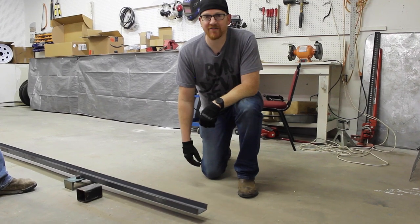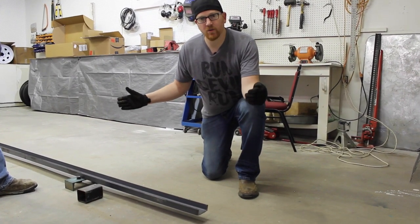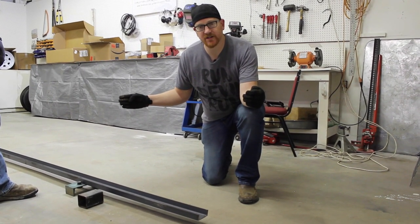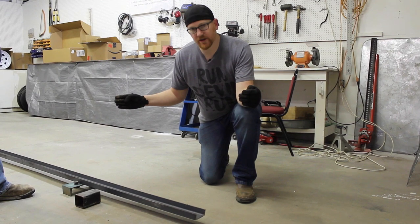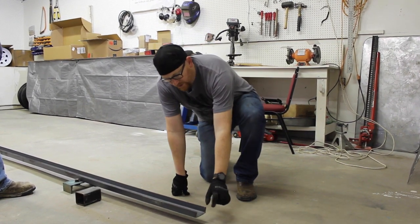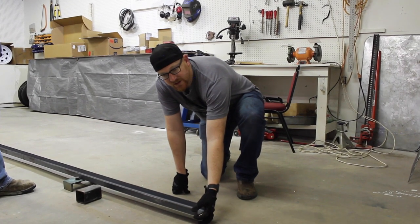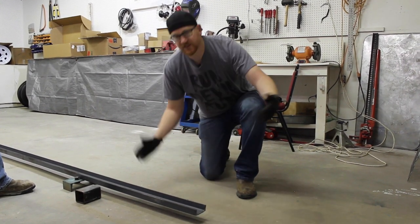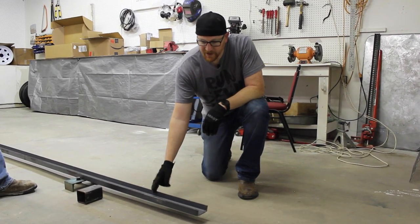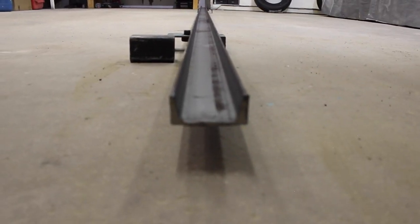So we're going to start off with a 74-inch axle dimension where you'd measure from the center to the center of the spring joists, and we're going to have to accommodate for the center of the width of this, which is 1 3/8. And since we have 2 on each side, 1 3/8 is what we're gonna take off of this beam, which is gonna leave us at 72 5/8".